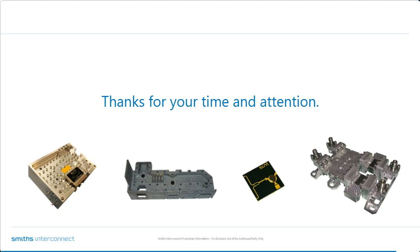All right. This person is asking, can an MFA help to minimize the unwanted effects of multipaction in a high power space environment? Okay, thanks, Katie. So the short answer is yes, certainly it can. There'll be a reduced number of coaxial connectors, which naturally will reduce the probability of any potential multipaction events. Any interconnects will be certainly managed by us. So with these sliding contacts, which was a theme throughout the presentation, we can use special techniques to prevent multipaction.